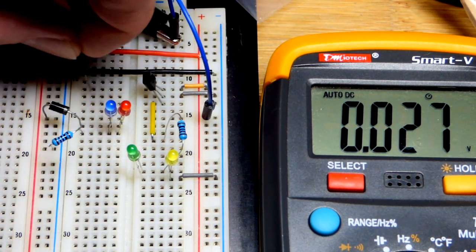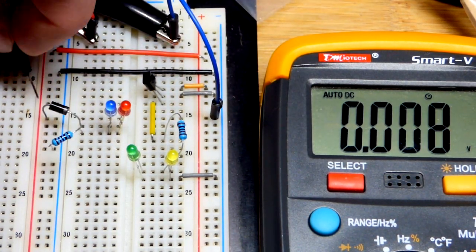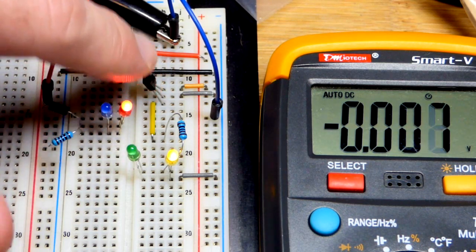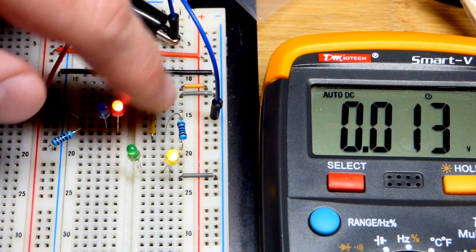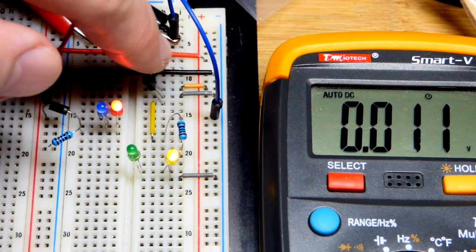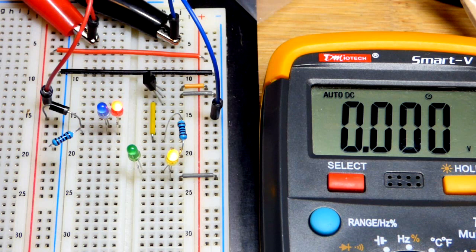It basically just breaks down and conducts. Now we have the polarities opposite of what the p-channel MOSFET likes to work properly, and when we looked at the schematic symbol, we saw a diode on there. There is a diode from drain to source there, so that it conducts. It's forward biased right now, so it starts conducting. It does have a diode drop, but once it gets some current going, it just starts conducting pretty much freely. That's a bit confusing. You've got to read up on that a bit more.